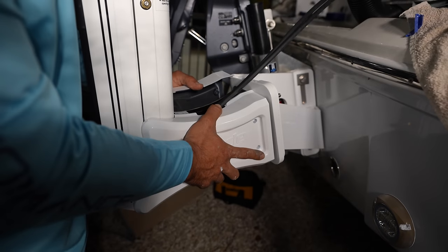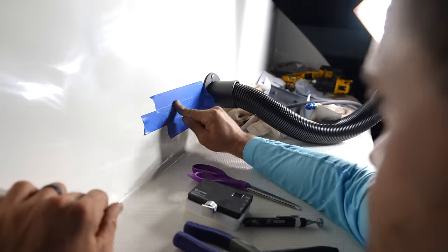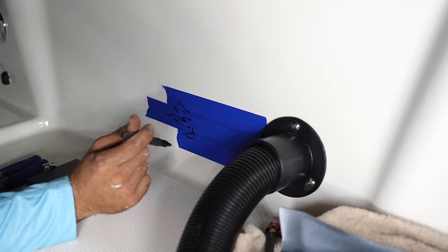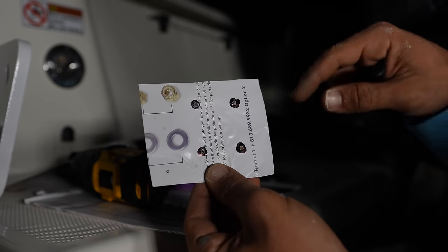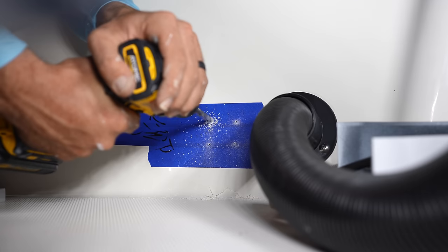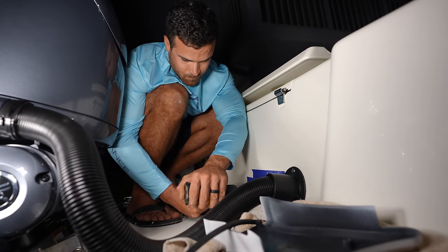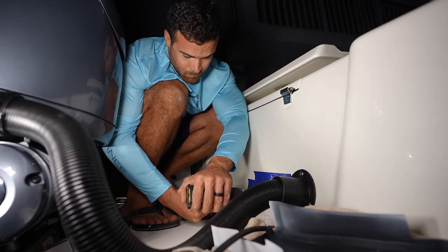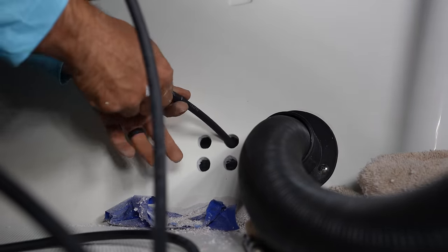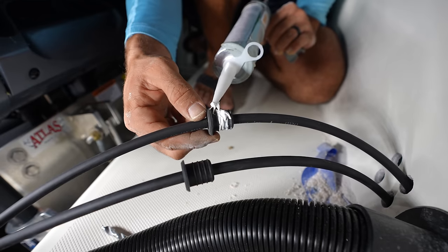After putting on the plastic covers, which are fixed by four screws on each side, we then had to decide where we wanted to run our hydraulic line. I chose right next to the rigging tube here just to get them very high above the waterline to avoid water intrusion. I laid down some masking tape and made a template so I could decide where to actually drill my holes. They always say measure twice, cut once — so that's exactly what we were doing. Then we started drilling pilot holes, and once we got through the transom and everything worked out perfect, we ran the hydraulic lines through. Power Pole includes rubber grommets on the hydraulic lines, so we took some marine grade sealant, sealed them up to make sure they were extra watertight, and just pushed them into the holes.